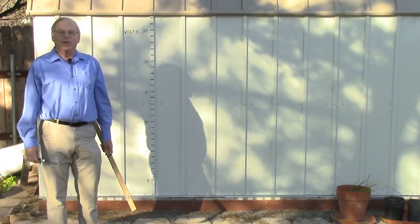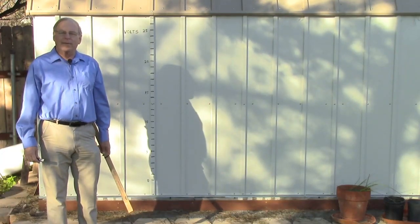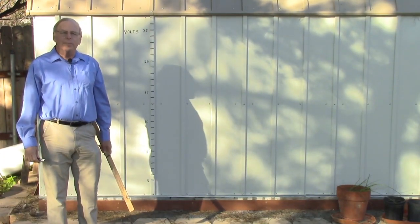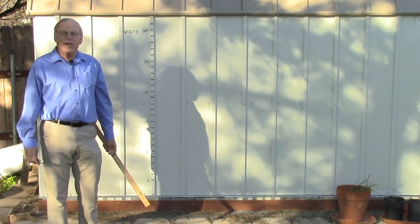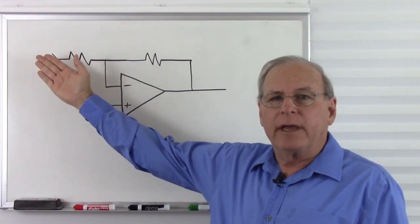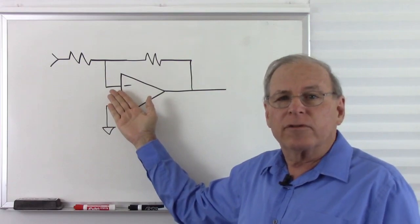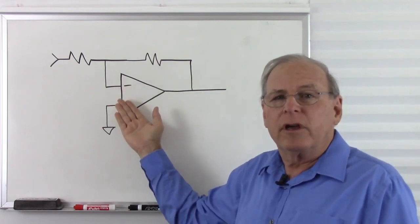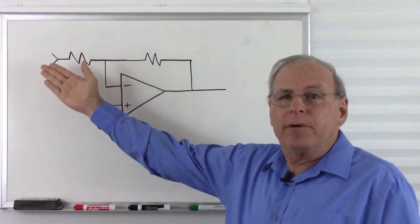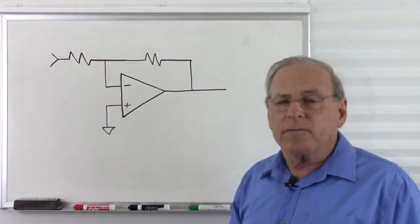Hello Dave. I'm making this video in response to your video on operational amplifiers, particularly on the section on inverting amplifiers where you said people become confused because of the signal at the input to the amplifier that seems to disappear at the virtual ground. I think the confusion happens because people see that we have an input at this point, but by the time we get to the amplifier it's zero volts, and the other input is also zero volts, so the inputs to the amplifier are always zero. So how on earth can an input here be having any effect on the output if the two inputs to the amplifier are always zero volts?